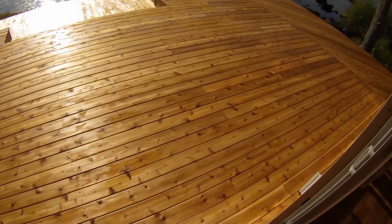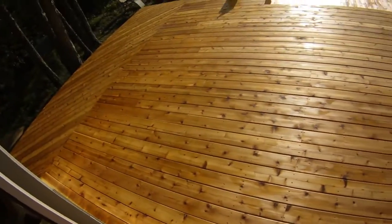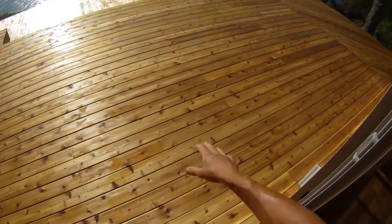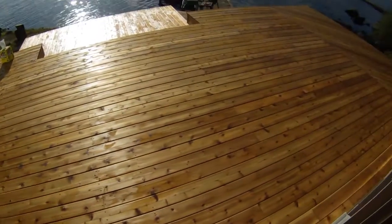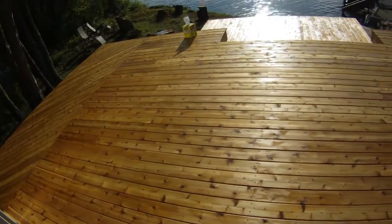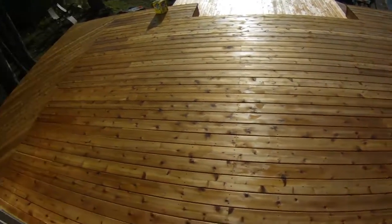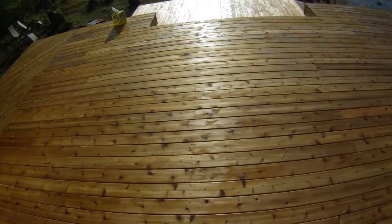As you can see, I just finished with the coat here — first coat, only coat, of Penofin oil. It's looking really good. It's been drying now probably about an hour and a half to two hours on this side. Just finished up the front. This is about a 900 square foot deck — used about three cans. Fresh cedar we just put down, brand new cedar. The colors look pretty good and you can see the knots really come out.